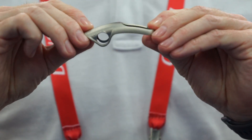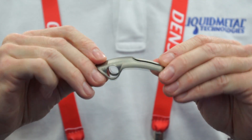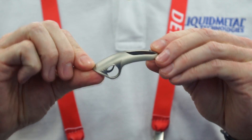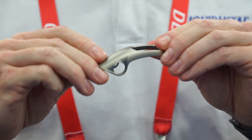This really sounds like a wonder material. Do we see this in applications now? Yeah, we have production medical device parts. You can imagine a part with contoured shapes and geometry — if you try to machine this out of anything else, that would be nearly impossible. Now you can use an injection molding process to get the geometry similar to a plastic injection-molded part, but with the physical characteristics of a hardened alloy steel. That seems very important — we've all had a plastic part that broke under stress, and now you can do it with metal and solve those types of problems.